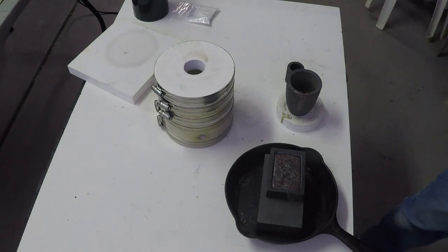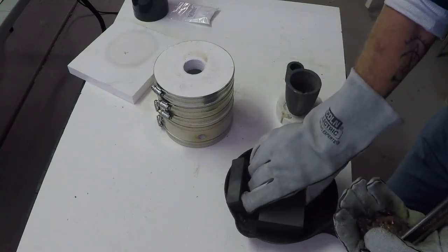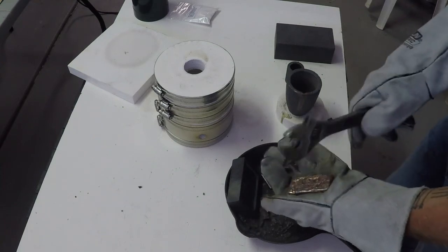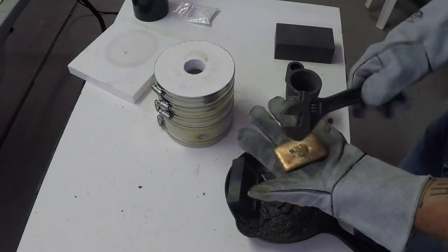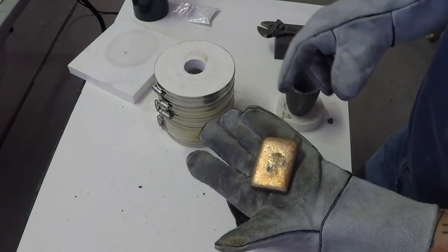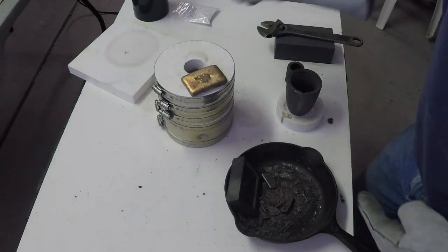Anyhow, I'm going to get my hammer. Wow, that crucible is still hot — this is going to be really hot. It popped right out. I'll take this out and catch this flux. Look at that! So that'd be a troy pound — 12 troy ounces. I always work with copper when I'm developing one of these kilns because copper melts at a much higher temperature than either gold or silver. So there it is.